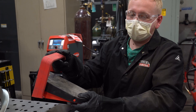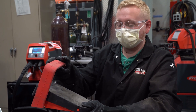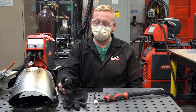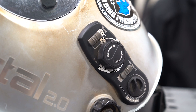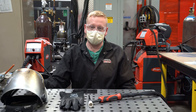The cool thing about this Fronius welder is we got a Bluetooth pedal, so you're not connected to the actual welder with this pedal. I'm going to go over the PPE I'm wearing. I have my welding jacket, I got my TIG gloves. These are a little different — they're thinner and they give you a lot more dexterity when you're using TIG welding. I've also got my helmet with my darkness set to 12. The more amps you use, the darker you need to go, obviously.